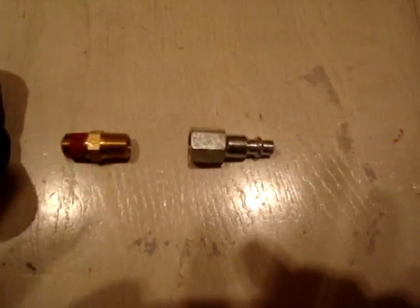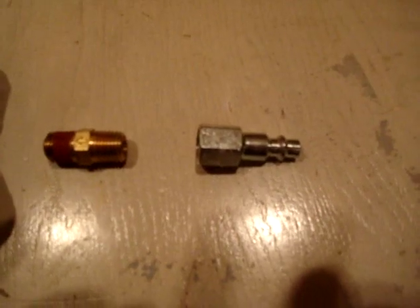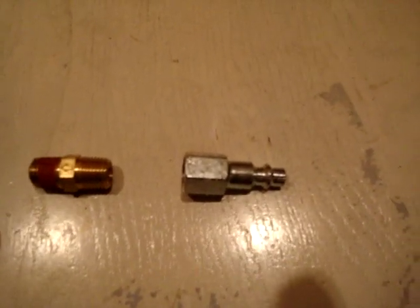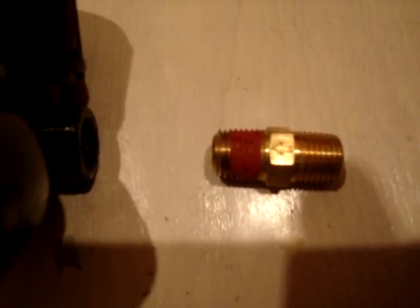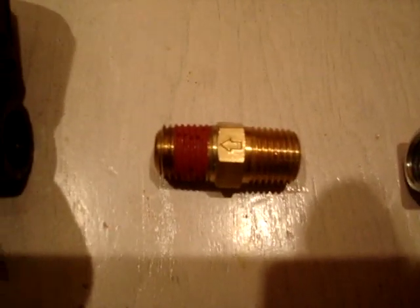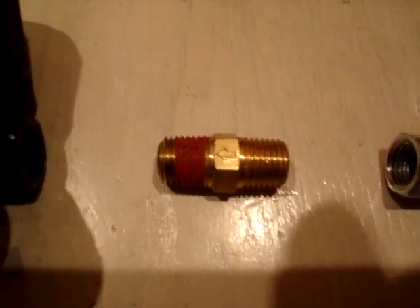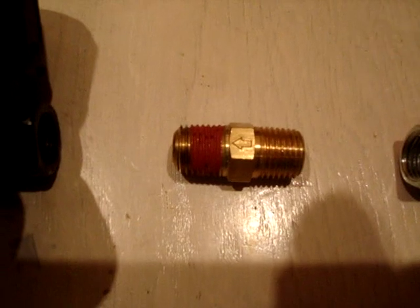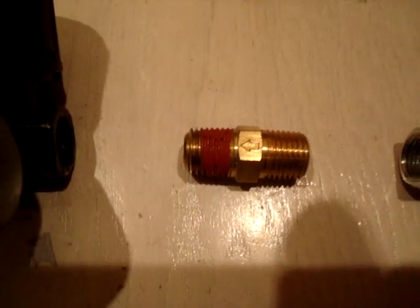We're going to start off with an air fitting. It's a 1/4 inch. You can buy that at Home Depot. Next thing you're going to need is a check valve. When you install these things, I don't know if y'all can see that arrow. All the arrows got to flow the same way. There's 3 things on here that have arrows, so they all got to point towards the outlets. This is a 1/4 inch check valve, and you can get that at Granger for like $7.